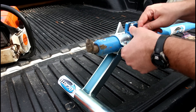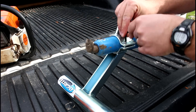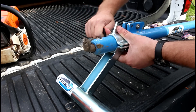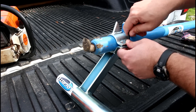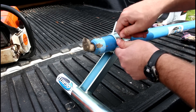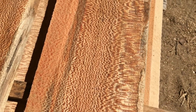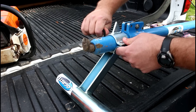We'll get this maple cut to size and loaded up in the truck. I've also got to make a stop at a buddy's landscaping company. That sycamore log I showed a few weeks ago — it's about 50 inches in diameter. He went ahead and moved those for me, and I cut them to eight-foot lengths before I went to Georgia, so they're ready. He spread them out so I can put anchor seal on both ends. Hopefully in a week or two we'll be going over with the chainsaw mill to get them quartered up for quarter sawing. Should have some really nice quarter-sawn boards come out of that tree. If you watched the Georgia sawing project video, you know sycamore looks really good quarter-sawn. That tree down there was about 39-40 inches and this one is about 50, so it should produce some really nice boards.